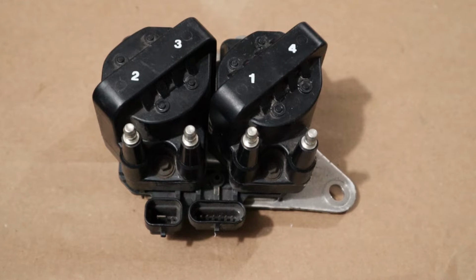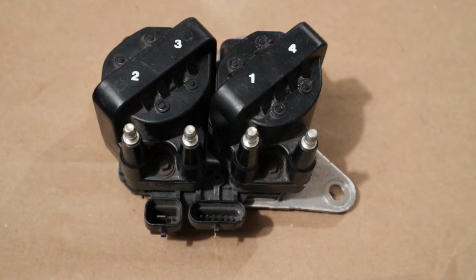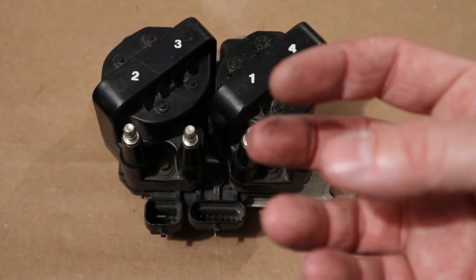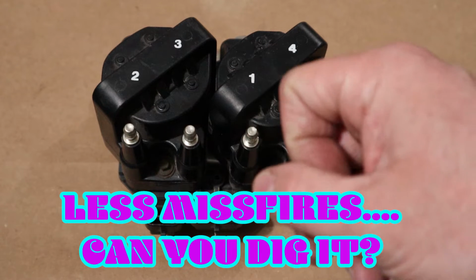So the coil packs, the way they worked, if you had this kind of system on a V8 engine, you now had 4 times the length of time that it needed to build up a magnetic field before it had to collapse again. So what that did is it made sure that you had a really good spark with a big high voltage instead of having to rush it doing its job.